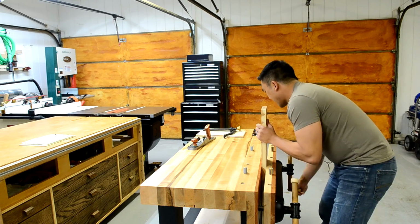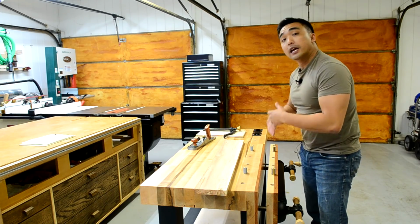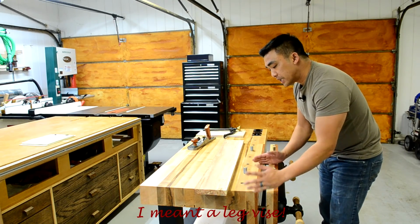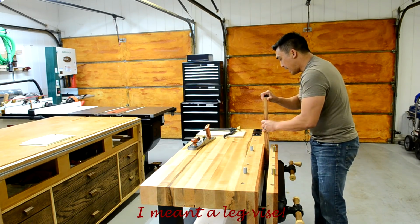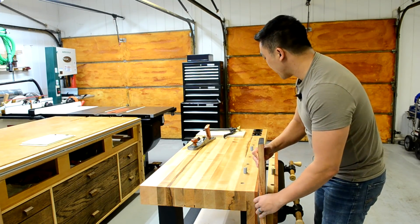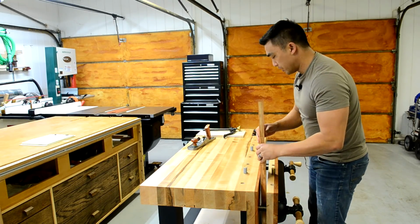What's really great is having all of that space, 24 inches between the screws. Now I don't have to worry like with a bench vise or maybe even some of the cast iron vises, having that screw in the center of your clamping space, which now you have to skew off to the side if you want to do dovetails, if you're doing like a wide panel and dovetailing a wide panel. Now you have 24 inches between those screws and full clamping capability.